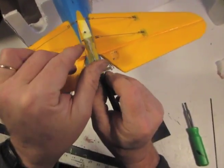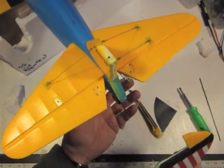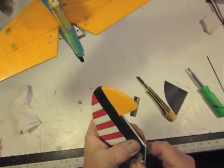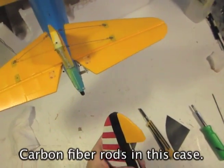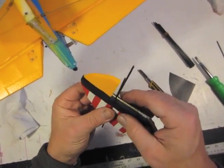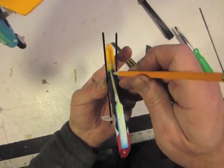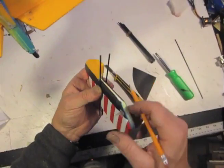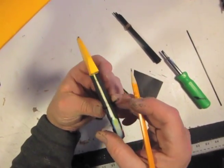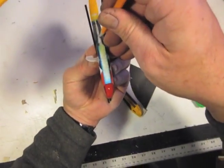Now I need to make a cut right down the center. You want these two pieces to line back up, so it's got to be right down the middle of each one. First we locate the center of each piece — I'm going to do that with a pair of sticks which will help me see where the outside edges are. I'll gently squeeze these to find my true outsides and then mark the center. This piece is not flat, it's fluted, which makes it a bit more difficult to locate the actual sides. So — center of that, once again.